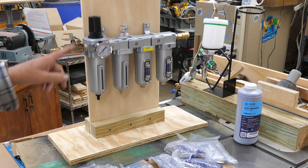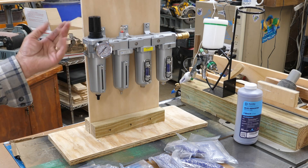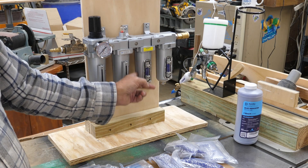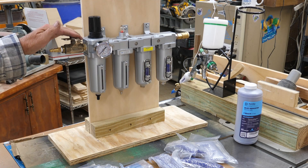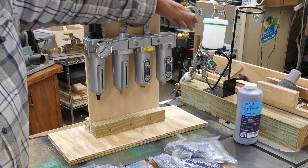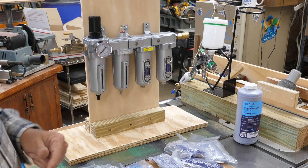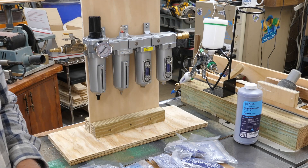So what's the purpose of this valve? When the unit is not in use, it would be open to atmospheric air, and if it's humid that would eventually turn the beads from blue to pink and you'd have to change them. So I put a valve on here to completely shut it off and isolate it. The other end, where my air hose hooks up, is blocked off internally anyway, so this keeps moisture out when I'm not using it.